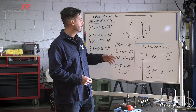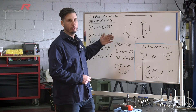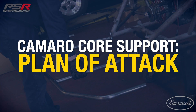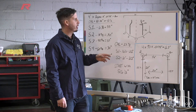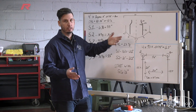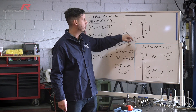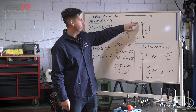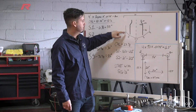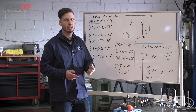So from here, we're going to work over to the Camaro and the core support, and it's a little bit more in depth. I'm going to walk you through how to make the three pieces that we need for the front. On the core support for the Camaro, we have three bars. Two of them are mirrored to each other, and one of them is basically a main hoop that's going to run through the front bumper. Bar one and two are pretty basic — they just have two bends in them in an S shape, and they come forward on the front of the frame and connect to this five-bend hoop that's going to run through the front. We're going to bend the whole thing out of one inch tubing.